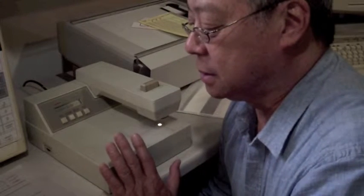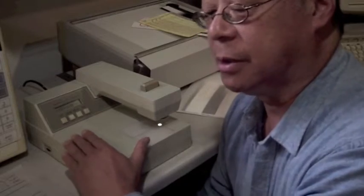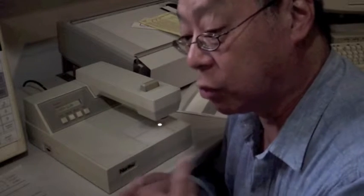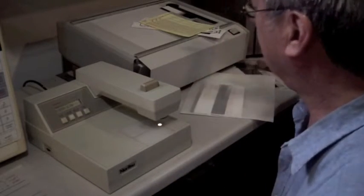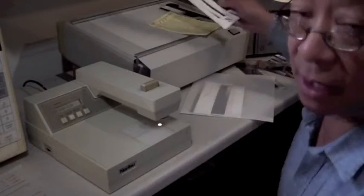Now, what's useful about this is it gives you a standard that you can rely on, this densitometer. Whenever I buy my paper in rolls, I buy 42 inch paper by about 100 feet, and I cut off what I need. And every time I order a new roll, I run this test. I have the exposure, I have the light level, and I have the time. I put it in developer and I process exactly 2 minutes.